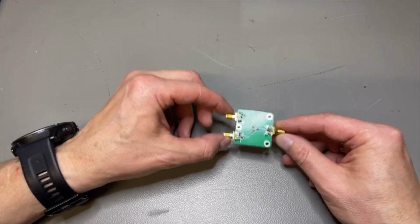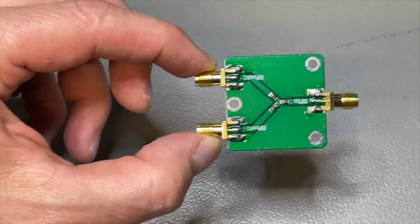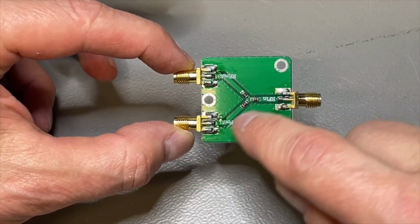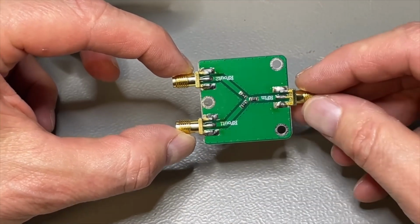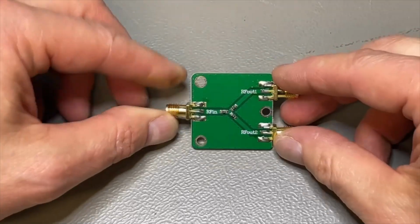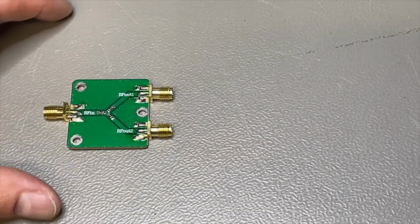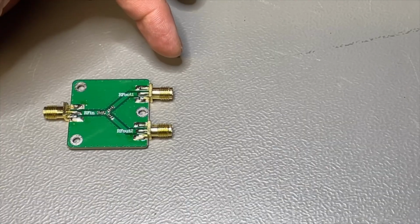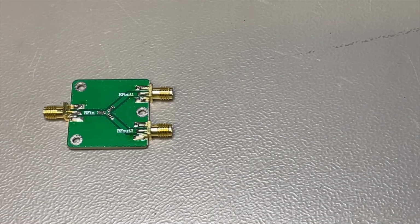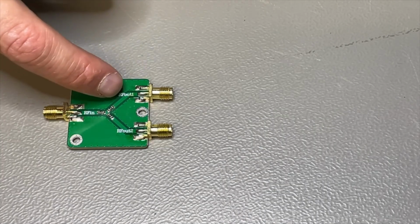One of the solutions would be a simple power splitter, power divider. It looks like this. I can zoom in a little bit. I think these are called resistive tees, and it's very simple. These are made for 50 ohms, and I just put resistors in series in kind of a Y or a T, depending how you look at it. It has one input, and then it splits into 2, and it is done with only resistors. The point, of course, is you cannot just put them in parallel, because it's 50 ohms, and if you put 2 receivers on the end, you will get 25 ohms. With these resistors in series, instead of 25, you have again a little bit more. I think it's 16 ohm, so you have 16 here, 16 here, 16 here.